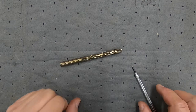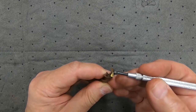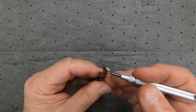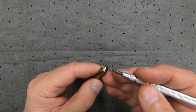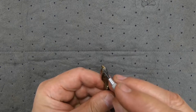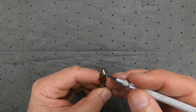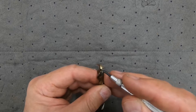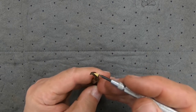So I've spoken about a four-facet method of sharpening drills — what does that actually mean? You can see here one of the facets, and behind it another separate one, so there are two of them. Turning the drill around, the pattern is repeated on the other side. The cutting edge has been formed by a flat grinding operation that creates a flat surface there, and the clearance angle has been achieved by putting a separate flat grind behind it. So instead of a continuing curve, there's a flat and a flat, repeated on the other side — hence the four facets.